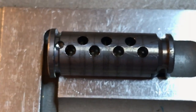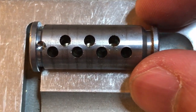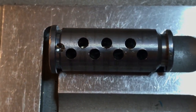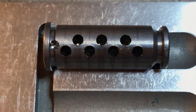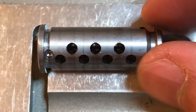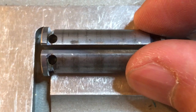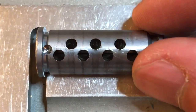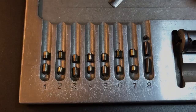Okay, moving over here to the core, we can see that really interesting configuration, the V configuration, right up at the front of the keyway. You can see up here, that's where the ball bearing came from. And then we have all our slots for the pins, no counter milling or anything like that. And then down around the bottom, we have those 2 slots that the long hardened inserts came out of. Okay, I think that's all I have for you on this Lockwood V7.